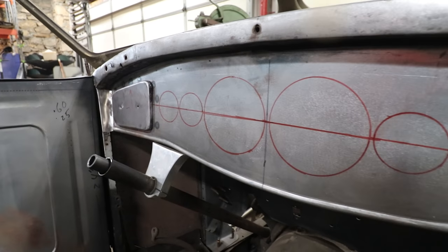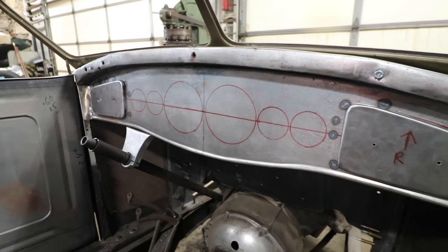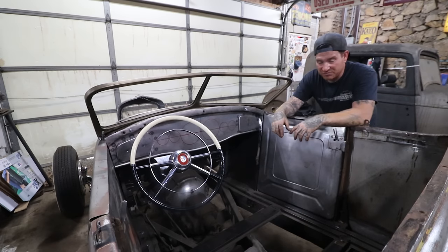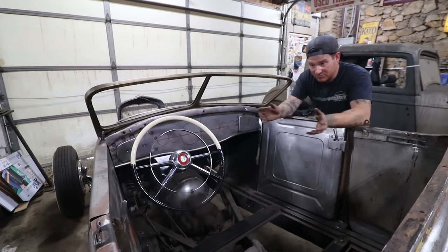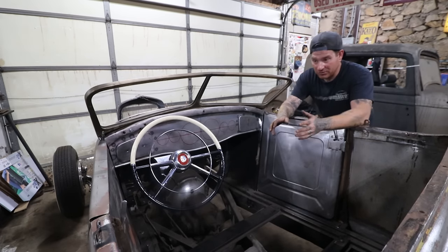I have not hemmed the edges over on those doors because I don't know exactly what we're doing with the inner structure. I may just wire edge it. I may make an inner structure that goes in there, but I haven't decided yet. Also with the hinges, I need to play around with hinges. We might use some kind of just simple piano hinges or cabinet hinges, or we may try and modify or use a set of '32-'33 window style hinges or even '34. But I need to gather those parts, test them, see how I like everything and how it looks,